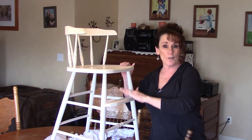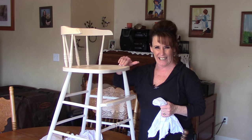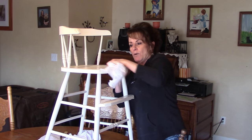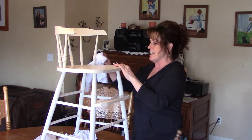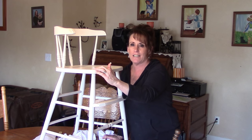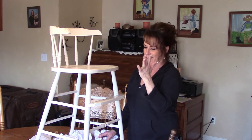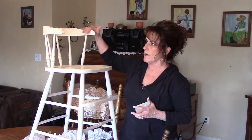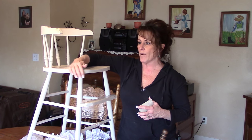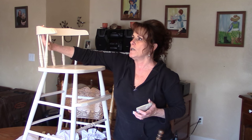I've got the wax on and let it sit. When you buff it, it's going to feel kind of tacky — not sticky, but tacky. Buff it like you were shining a shoe until it's slick and you get a little sheen, not super shiny but definitely a nice sheen. The seat already looks rustic with brush strokes going both ways. I'm using 100-grit sandpaper for distressing — you could use sanding blocks but they're a bit expensive. Wherever the chair would get natural stress or wear marks, we're going to distress. Make sure you don't feel tackiness before you sand a spot.